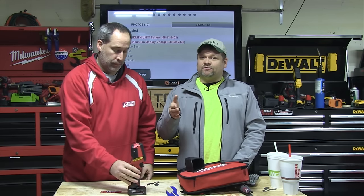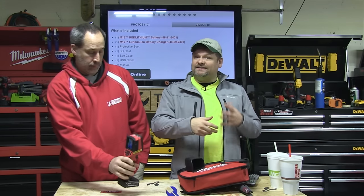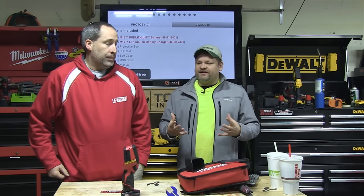You can pre-diagnose things if you have electric motors. And this electric motor is getting pretty hot. You can get right on the bearing. Is that bearing heating up? Yep, that's an indication that that bearing is going to fail. So you can predetermine that things are going to fail. Preventive maintenance, definitely something that's needed in your arsenal. And like Eric said, you don't have to tear things apart.